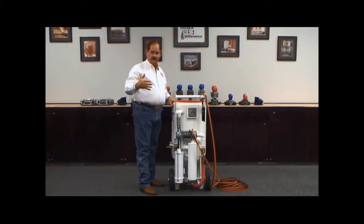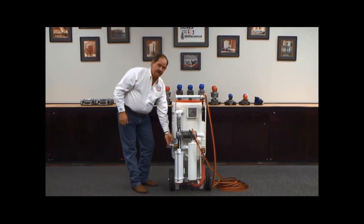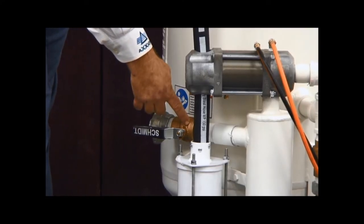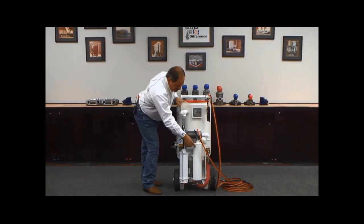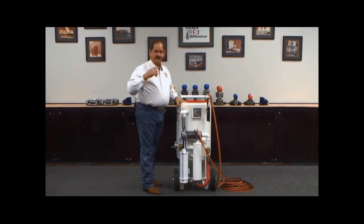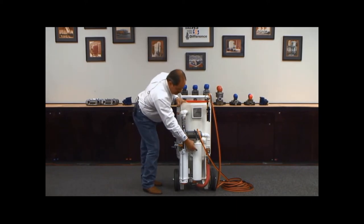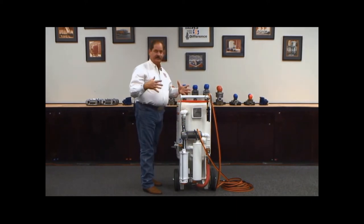The non-pressure hold system works like this. I have an air inlet which is supplied from your compressor, hopefully through some type of moisture extraction method. This is your air supply to the vessel — where your air is brought in, it comes through an inlet ball valve into this moisture separator. It's set on a tangent such that it creates a cyclonic effect of the air inside this moisture separator, which spins out any of the condensate that may be in your air supply.